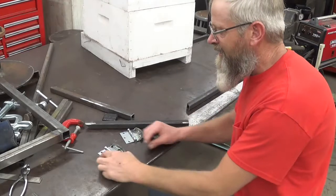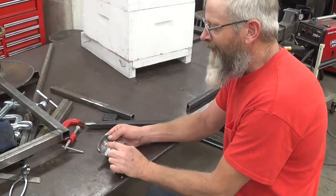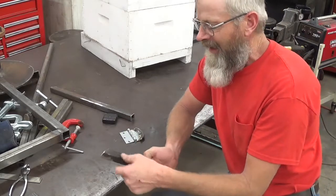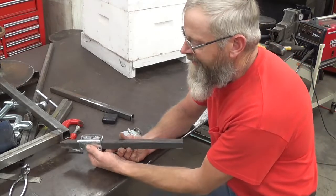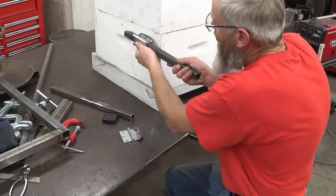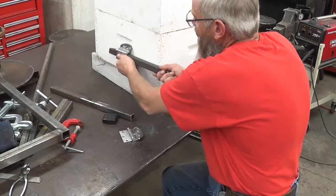What I've done here is grabbed a couple of three inch hinges and a little piece of three eighths rod. I put the rod in the press and bent an arc in it, and then I took a piece of my box tube and put a 45 on the end of it, so I'll weld this hinge on here like this — it'll flop like it's supposed to — so as we come into our box, it'll drop down in the hand hole and we can lift it. Then when we're wanting to set it down, we just come down and out.